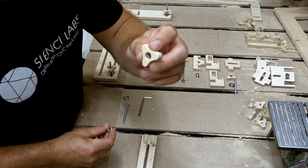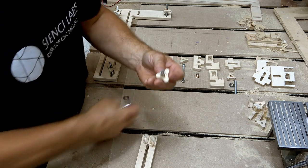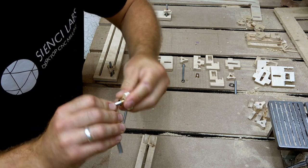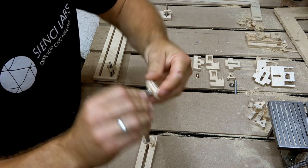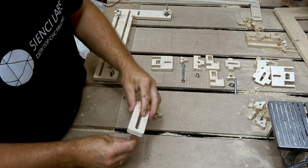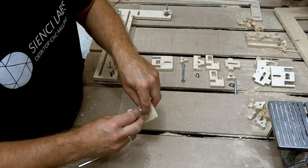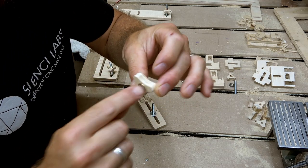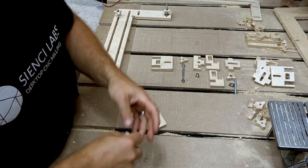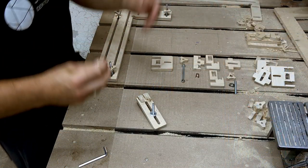With the basic work holding, we're going to grab what I call the threaded knob and a threaded insert, grab your allen key, and just start twisting — twist the wood, twist the allen key. Eventually it will stop twisting and you will have yourself a threaded knob. From there, grab a T-bolt, slide it up through the tongue, grab a washer, slide it over top. A little hint: the way you twist the threaded inserts into the knobs matters — if you tighten them right side up, the wood can loosen when you're loosening them; if you use them upside down, you're tightening them more and the wood doesn't tend to loosen.